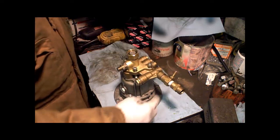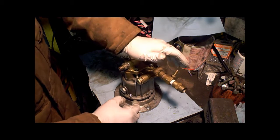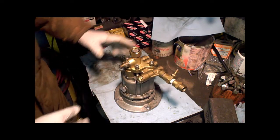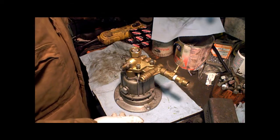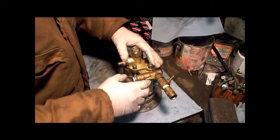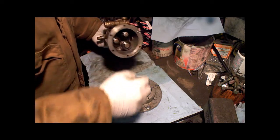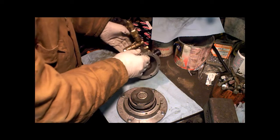There are five or six Allen screws around the perimeter, and it'll be spring loaded. As soon as you start getting the last one out, you'll notice it just wants to come up — it's not a big deal, it's not going to go far. I've already drained the oil and taken this apart to order the parts I need. I just loosely reassembled it. You can take that off; it'll just pull right out. It'll be all oily, and these might fall out as well — they're just loose in there — but this is your main bearings.